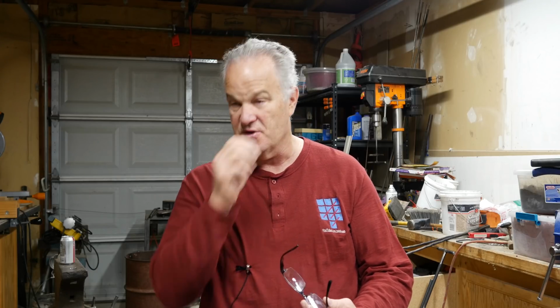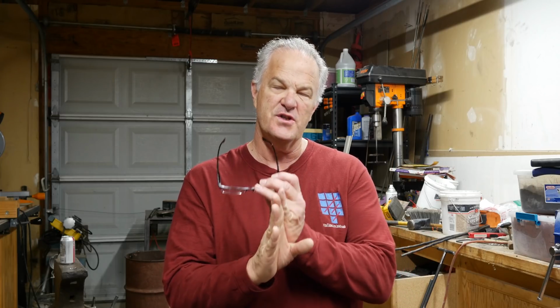So from my blacksmithing time, the experience I got there, I know that when you quench metal, it changes the characteristics of that metal, or it locks them into a certain state. Because when you anneal metal, you tend to relax it, kind of soften it up. When you quench it, a lot of times, what happens is you are hardening it. With some steels, especially, you'll get it to a critical temperature. You'll quench it in oil or in water, cool it very rapidly, and it stays in a more crystalline structure or something. I could be wrong, but it stays in a state that allows for a very hard but brittle edge.